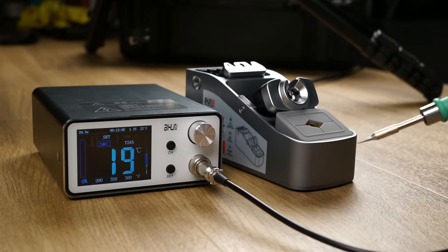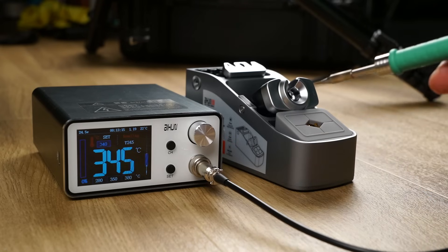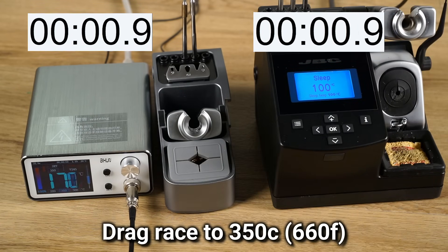The rest of the menus include just about every option you'd hope to see on a soldering station, along with three customizable temperature presets. With the iron at room temperature it takes only a couple of seconds to heat up, assuming the temperature readout is accurately tracking the tip temperature. This thing easily competes with the genuine JBC for heat-up time.